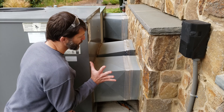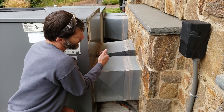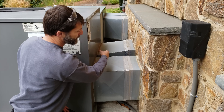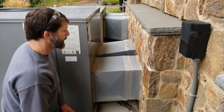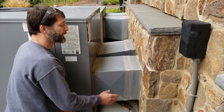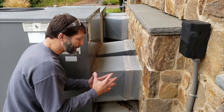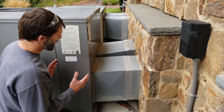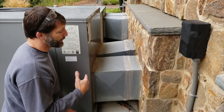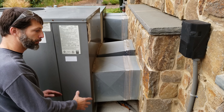A couple of bonus tips on airflow and ductwork: if the supply or return ducts are exposed to the elements they will rot, potentially blowing air outside or sucking outside air in — you may need to make a shroud to cover them. Also, animals can enter crawl spaces and collapse flex ducts. Don't forget that the air filter on package units is typically located inside the building — keep it clean to ensure proper airflow across the heat exchanger coil so the unit doesn't overheat.